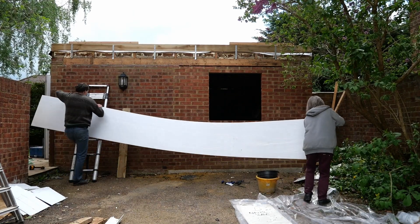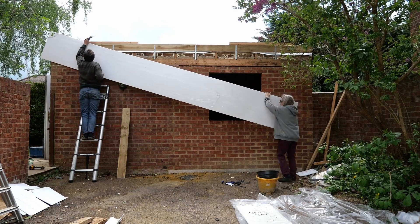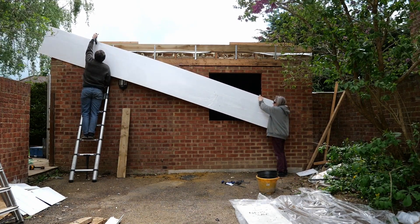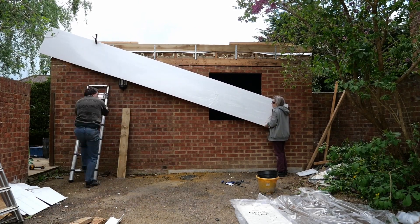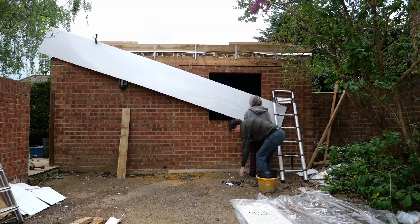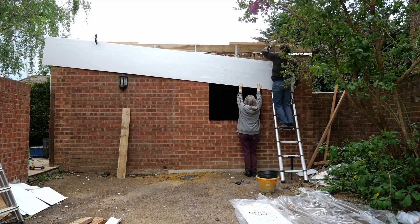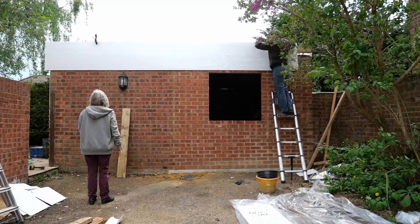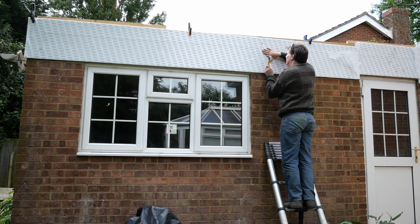Because of the way that rubber roofing works, it's advisable at this time to put up the fascia board. The rubber roof will then go over the fascia board and it will form a watertight seal. We struggled to get fascia board which was the width that we required and we had to use soffit board. Don't use hollow soffit board though because it's not actually watertight. To install the soffit board I clamped it into place on the wood that we just put up, then used plastic top nails which were white and hammered those into the soffit board.